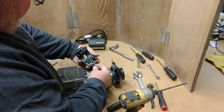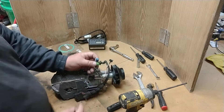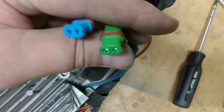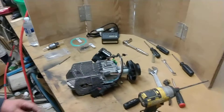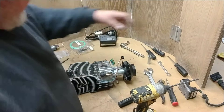This box is just a bunch of plugs that get unplugged — they only go in one position. You can see the little notches inside: some face forward, some backward, meaning they can only plug in one way. Don't force them when you go to put it back together, and make sure they're all plugged in, otherwise you're going to have an inoperable heater.